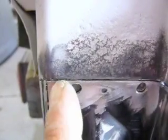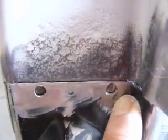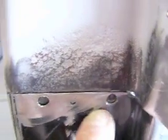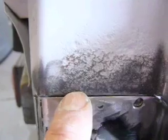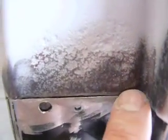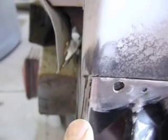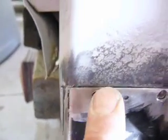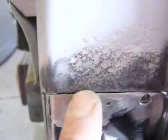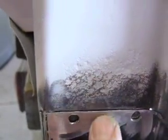If you look closely, this is the area where it has a flange underneath that's stepped down. So, on the patch panel, along that edge, I beveled the edge. I don't want to bevel this edge because it's an open butt weld and I need that metal in there for the heat. But I bevel this edge so when I clean up my welds, it's nice and even.